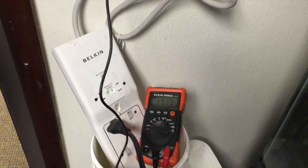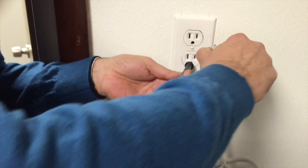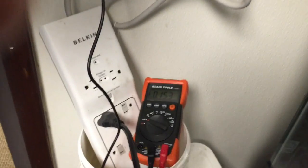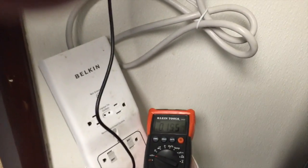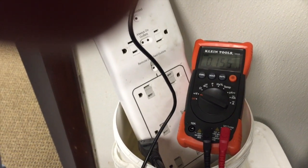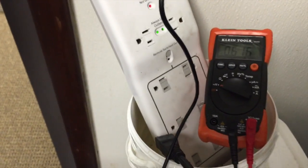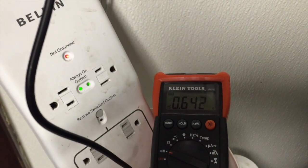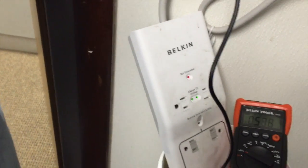What we just did was check using the power cord. We'll actually take the power cord off. When you take the power cord completely off — without the pump, with the multi-plug not plugged in — the water's reading 0.15. Just by plugging in the multi-plug, which isn't even attached to the aquarium, we now get a reading of 0.62. This shows that you can get a reading and think you're testing your aquarium, but it's not showing voltage in the tank — it's actually the plug itself, or the meter, showing voltage from a multi-plug or how the wiring is done in the wall.